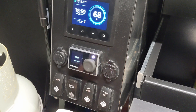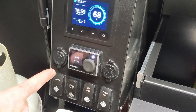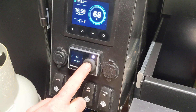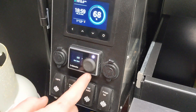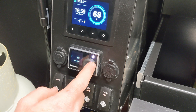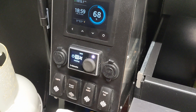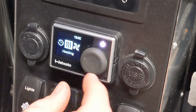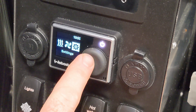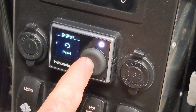The hot water switch is like a circuit breaker in your house — it's not the on/off switch, you're basically just powering the unit up. It first asks for the day of the week, so scroll the wheel to Friday and press to execute, then set the time to seven o'clock and press enter. The unit is now set and thinks it's 7 o'clock Friday night. Scroll all the way right to Settings, enter the settings menu, scroll right again to Reset, and press enter.